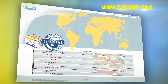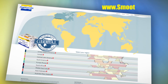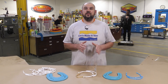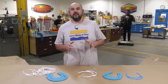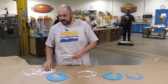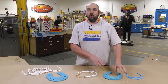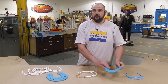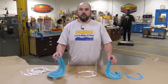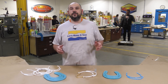If you got inspired by this project and would like to give your own projects a go and need some material, you can visit any one of our distributors around the world. And there you have it — a simple step-by-step procedure on how you can make these face shield frames in a very fast, timely manner. Remember, we went from a 3D print to a mold within 30 minutes and then used that mold to create the first castings within an hour. After that, we went back and made more molds so we can create many, many castings within a very short period of time.